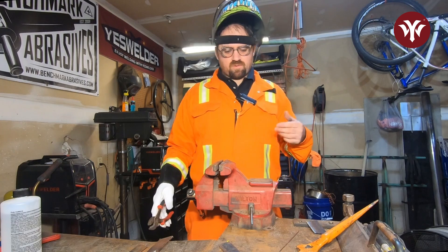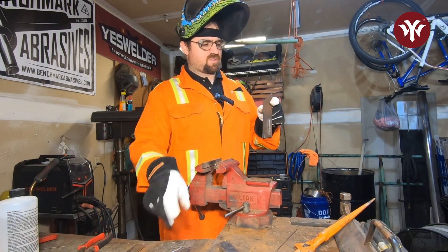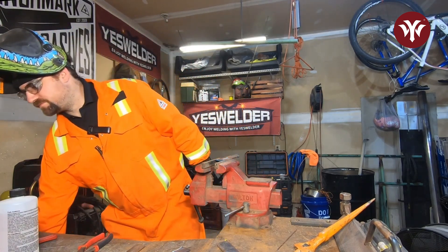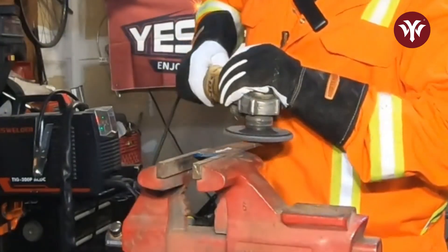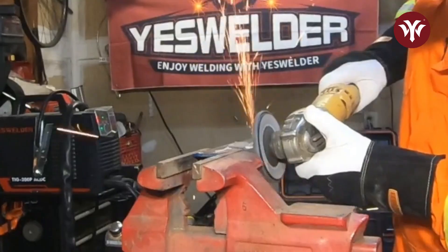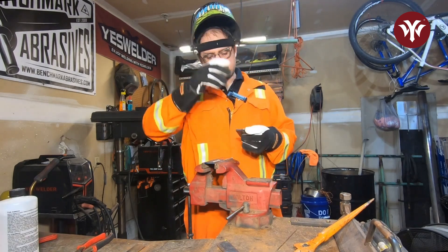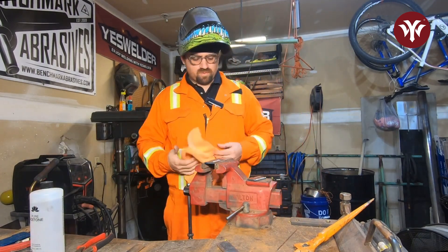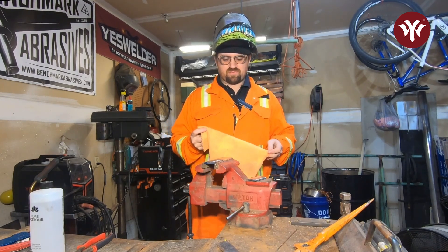So now we're going to take a piece and properly clean it and show you the difference. I'm actually going to use the same pieces so we keep everything similar. The first way to do it is by mechanical means with the help of some power — a flat disc grinding wheel — get all the scale off and get it down to sound metal. Sanding part is done. Because TIG welding has to be super clean, I am also going to take some chemicals and clean this up. I have here pure acetone. The acetone will not break down oxides or rust, but it will get all of the dust and debris that is sitting on top.